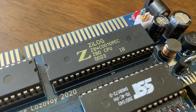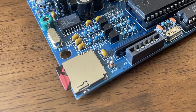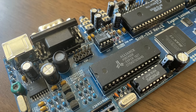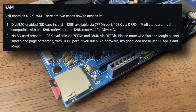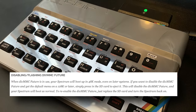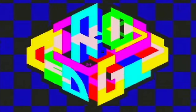We have a switchable ROM, so we can by default boot to the 128K standard ROM, or the Plus3e DivMMC ROM, and then load off the SD card from the slot on the left-hand side of the board. Yes, that's DivMMC built in — interesting when you consider that this board costs less than a DivMMC Future. The 512K of RAM manifests in two distinct modes. If there's an SD card in the slot and you're running the DivMMC ROM, then 128K of that memory is reserved for the DivMMC, 128K is reserved for compatibility with 128K software, and 128K is available as page memory. With the Harlequin, plugging in the DivMMC demotes you to running only 48K games safely, as some of the machine's 128K is taken up by the DivMMC software. If you're running the standard ROM and no SD card, you've got 128K standard memory and 384K available for paging — great for some of those big mega demos.